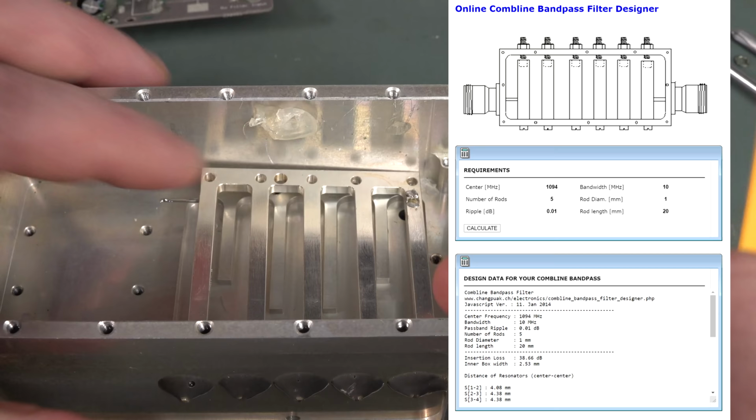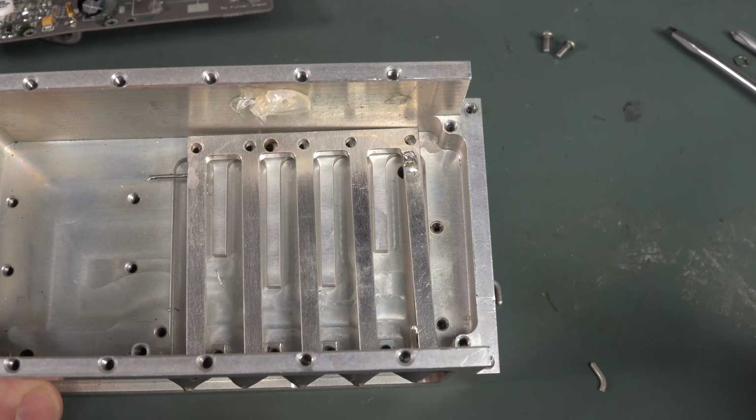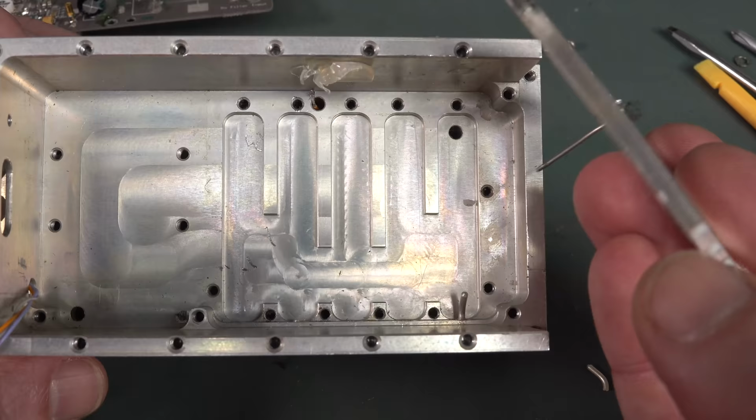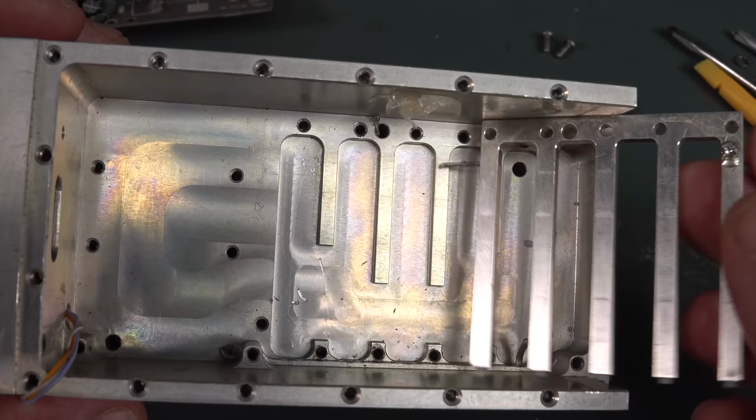It's just RF voodoo, right? When you have the output of the antenna shorted directly to your metal case, yet it works because it's 1 gig and things operate very differently at high frequency. But yeah, that's it. There you go. It's a comb filter with some of the combs actually milled into the grounded chassis. It's absolutely remarkable. I'm sure the RF aficionados are really getting excited about that one, because that really is just amazing. I'd love to talk with the designer about that one.